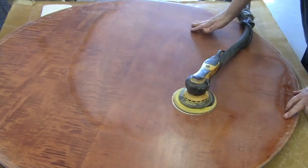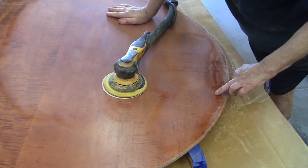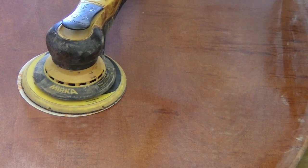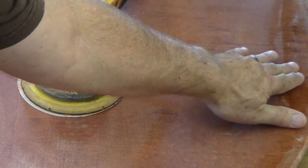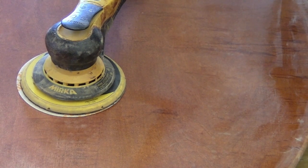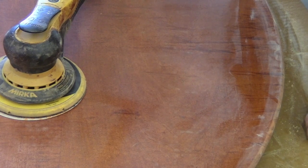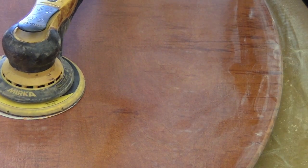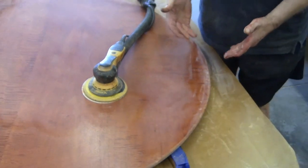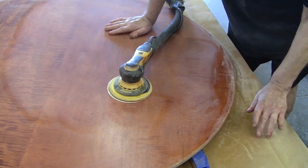Okay, you see right here, for whatever reason, and you got the camera on? Can you see right here there's a scratch? In reality, that's not a scratch. It just looks like it. Feel it, Jeff. It's high. Now, you see me use that big buffer, but this is where it went through the Performance. And again, as I've explained, it doesn't matter if it's a planer knife or a sanding grit, it can cause compression. And the trace coat, it didn't come out, it didn't raise up, but now that the dye's on it, there it is.